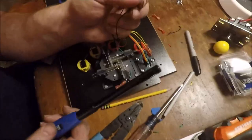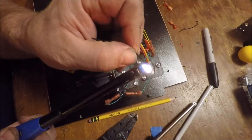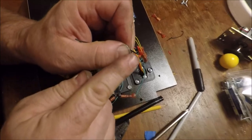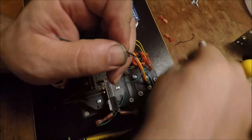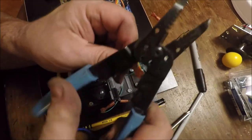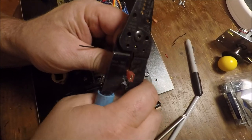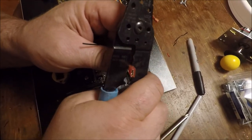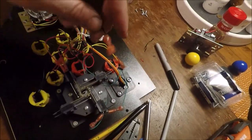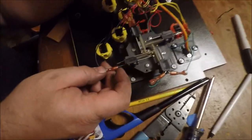I want to show you how to strip these wires since they're so small. Just get yourself one of these lighters, hold it on there for a second, then use your fingernail and pull it right off — and now it's stripped. Grab your connector end, put it on, use your crimper and crimp it on. You could use pliers if you don't have a crimper, but now would be a good time to go out and buy one.